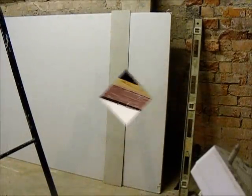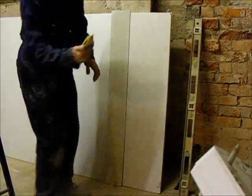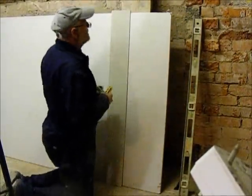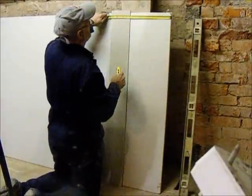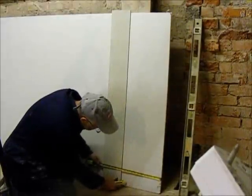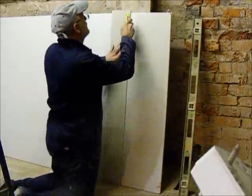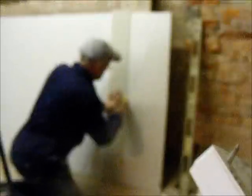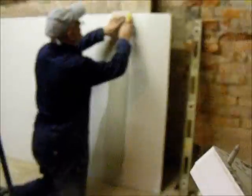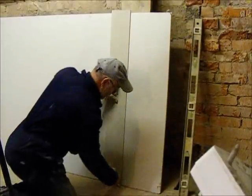And get some plasterboard on. So cut the plasterboard with a knife. Something thin, with a straight edge. You want a 12-inch piece or 300mm near as. Measure so. Simply always keep your hand behind the blade as you cut. It's so easy to slip off and hook across.